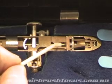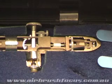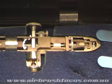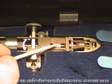You'll know when this Teflon needle bearing is loose because your flow while you're airbrushing, while you're working away, will give you a really uneven flow. It will, but in a rhythmic way. It'll give you a line and then chug, and then give you a line and then chug, give you a line, chug. And it's that rhythmic break that is the telltale sign that this Teflon needle bearing is too loose.